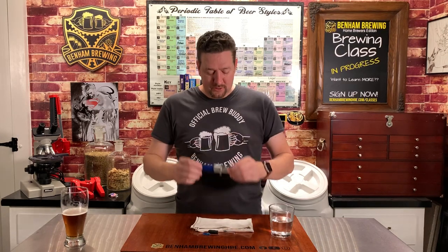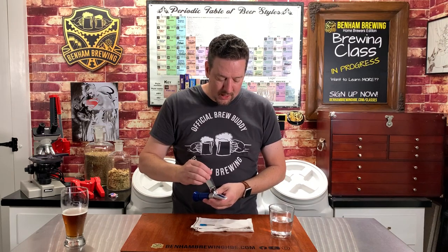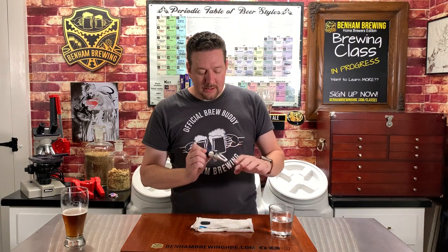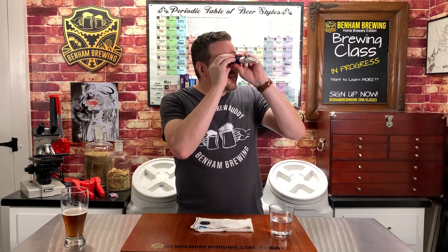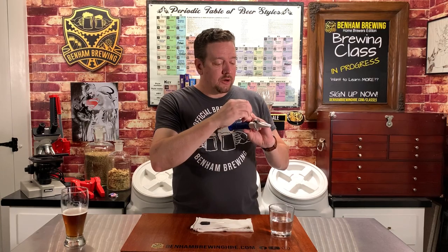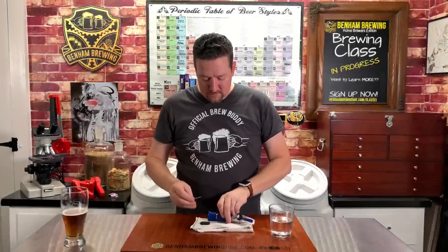There are two ways to calibrate it. First is with distilled water — you want to use distilled and not reverse osmosis or spring water, because the minerals can really throw off the readings. So you have distilled water, a refractometer, an eyedropper, and for this particular model, a screwdriver. Take your refractometer, add distilled water, close the plate, make sure there are no air bubbles and it's a nice even coating on the glass. Point it toward a natural source of light — natural light is best. As I look at this, I can see we're a couple of points off; it should be reading at one. So I take the screwdriver, stick it in the top, adjust it, and now it's calibrated.